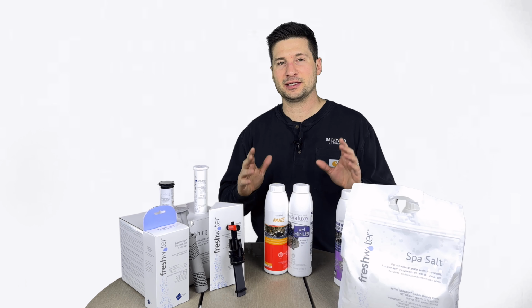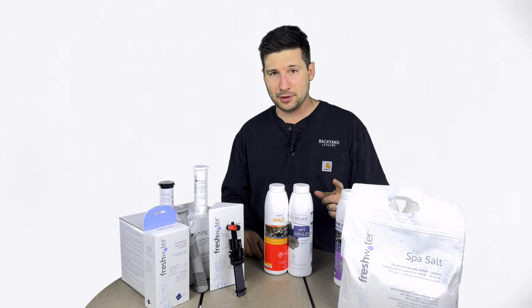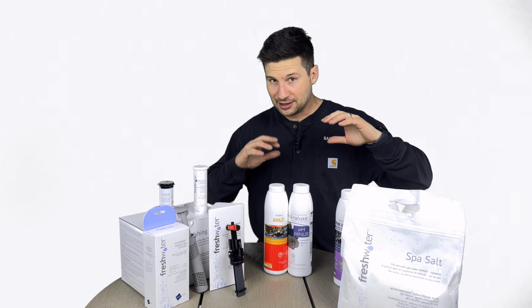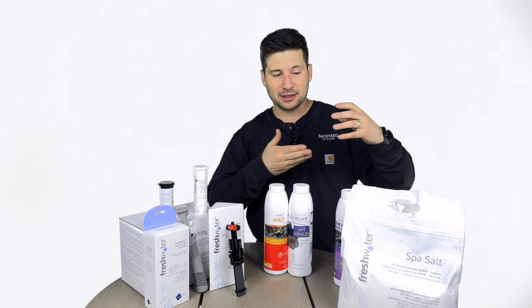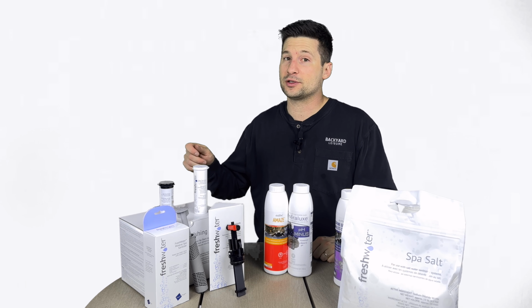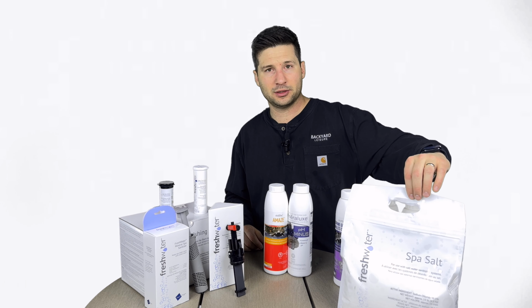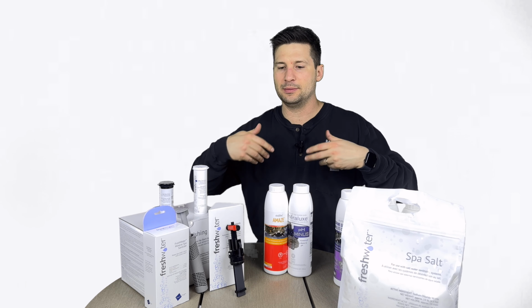We want you to have the best saltwater experience for your hot tub, so we've got a few pro tips for you. Pro tip number one is that the salt in your hot tub doesn't get consumed and used up. It just keeps recycling from chlorine back to salt. The only time you should really have to add salt is when you're adding fresh water, which doesn't have salt in it. Some of the salt does get dragged out with your bathing suits or splashing, but you shouldn't be thinking of salt as something that just keeps getting used up.